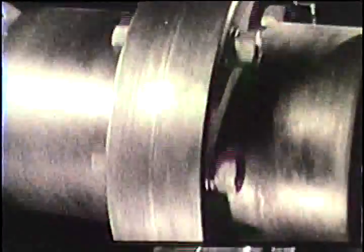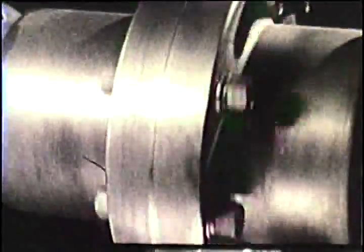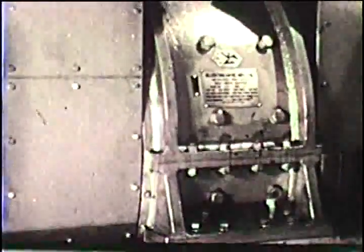Propeller drag turns the shaft and motors as long as the ship is making headway on the other screw, and when the motors turn, they circulate current through the propulsion loop. The generator stops with the engine, and current flowing through the stationary commutator may burn the bars. That's why the generator should always be cut out of the propulsion loop when its engine fails.